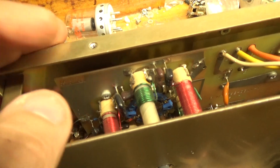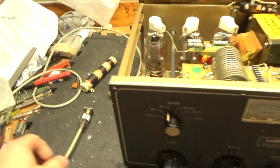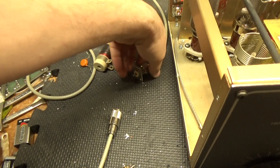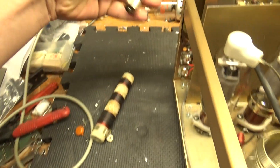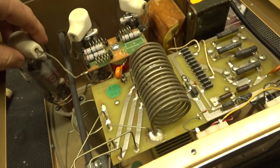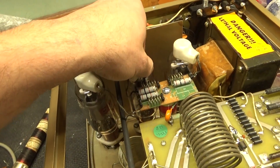There was a lot of solder drippage back here — I got rid of that. Here's the good part; I've only seen this happen on one other Ameritron 811. I have a jumper cord with PL-259s, and I have the old SO-239s plugged in — watch this. There's no tension at all, no grip whatsoever, as you can see. Now I have the new ones in — push it in, nice and tight. One of the screws was stripped, replaced that. These are silver-plated with gold-plated center conductor. A couple of these were loose; the material was spread too much so you couldn't feel it making connections. I repaired that issue.